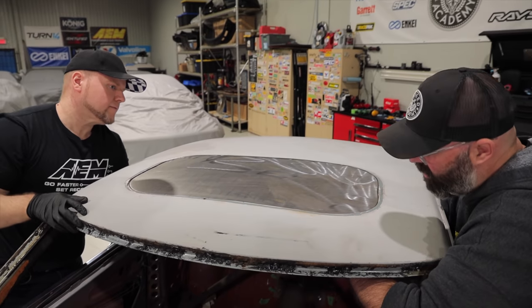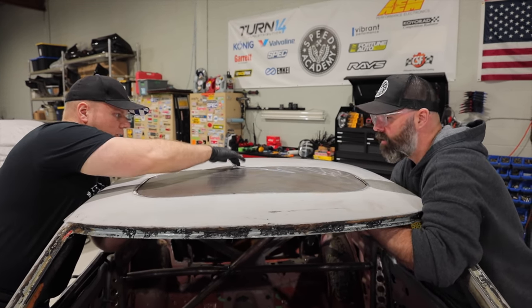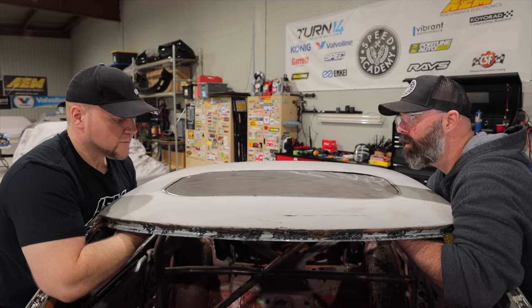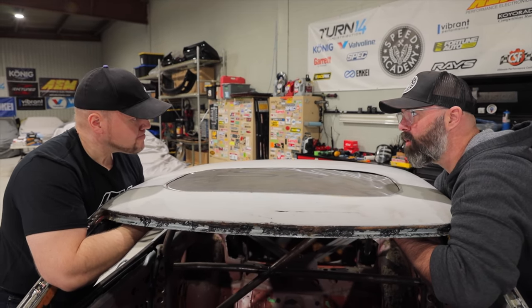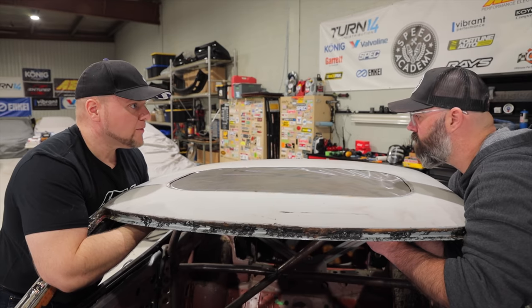And so what about the curvature and everything? Is it looking pretty good? Curve looks good. We were talking also maybe add a little bit of reinforcement because even with this thing welded in, it's still pretty floppy. It is. You're going to need 20 pounds of boom mat to keep the tinniness out of it. Maybe a reinforcement bar in there to help it hold its shape a bit. That's easy to do after the fact. All right, so what's next? Welding. Tack it in?